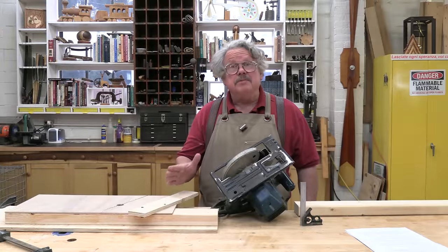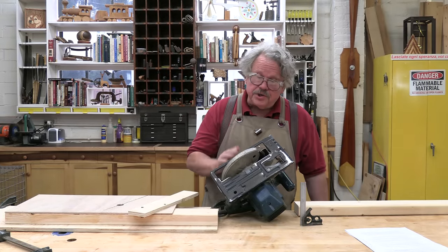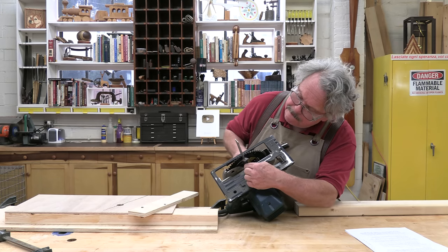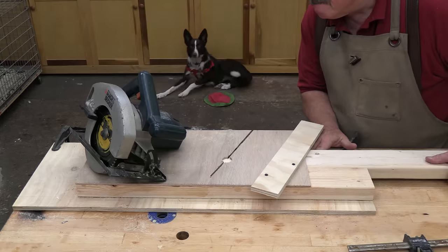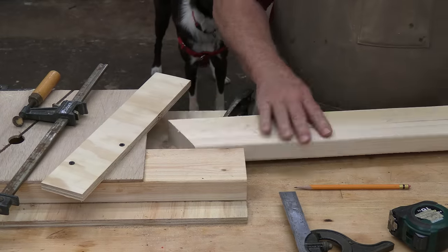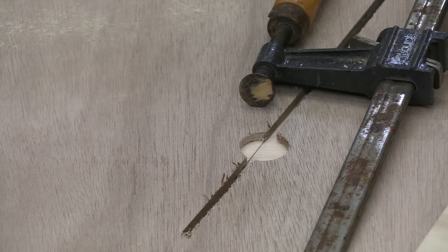While you are set up to make 25 degree miters, make the spacers. First, readjust the circular saw so the sole is square to the blade. Make another pass over the jig to trim the table with the blade square. Cut the first miters, then turn the stock top for bottom. Mark the length of the spacer on the stock and cut the second miters.